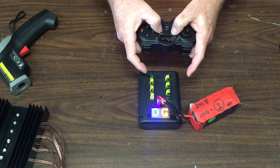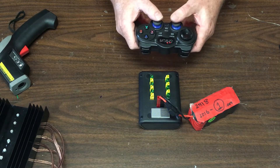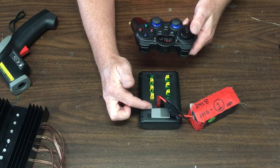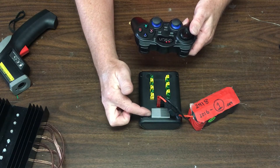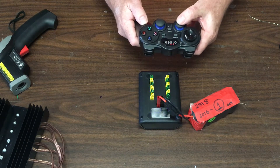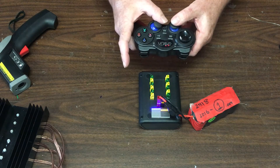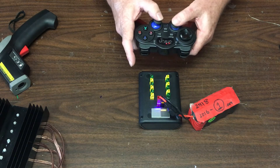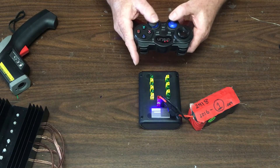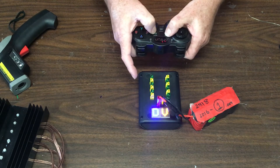The motor output mode shows what output power is being sent to the motors when I move the sticks. There are six motors, displayed in pairs with gaps between them, giving six statuses. In my current mode, going forward and backwards sends the same power to the first and second thruster. If I rotate, it sends opposite power — so you can clearly see what's being sent to your motors. That's pretty useful to make sure things are working correctly with your thrusters.